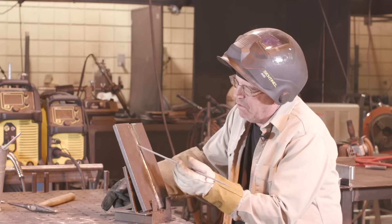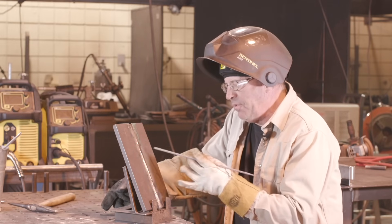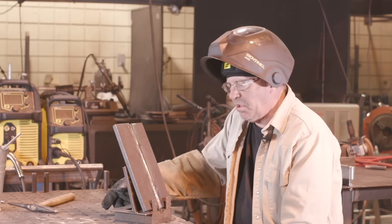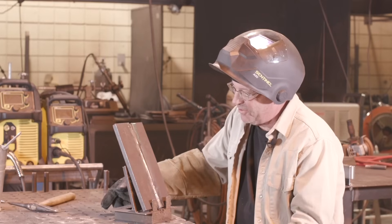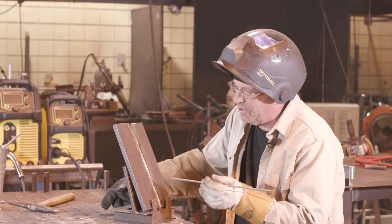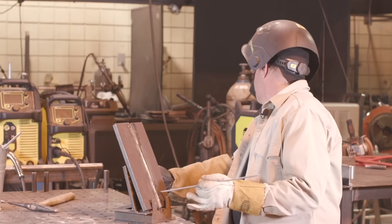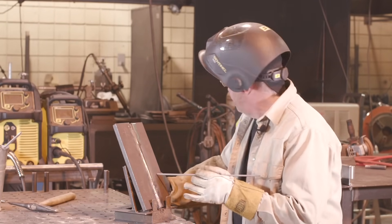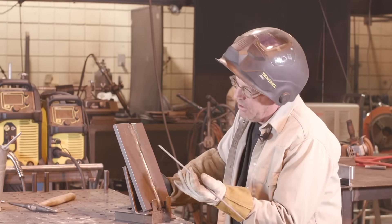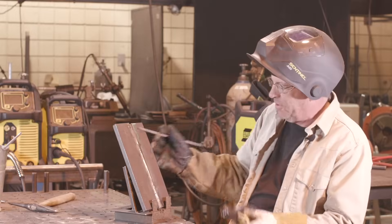I've ground this out. I do not want to restructure what went on back here. When it comes to a bad fit, I'd rather weld it uphill and control it than weld it downhill. To me, it's just easier to get the reinforcement and control that keyhole going up. I've got 70% dig on the Rebel Renegade here — 115 amps, 5/32-inch. If it's not hot enough, I'll definitely turn it up.